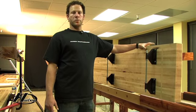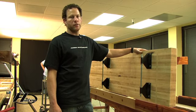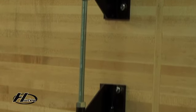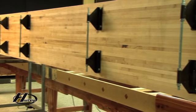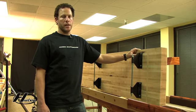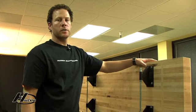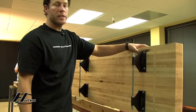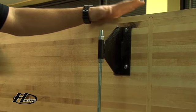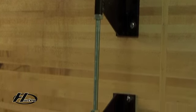The next step is to get your plank ready to be put in the cradle. Make sure you have plenty of help because these planks are very heavy. Your plank has climatic adjusters, and the amount varies depending on the length of your table — it could be anywhere from three to eight. If your table does not come with them already attached, this can be done easily by putting the lag bolts into the pre-drilled holes and tightening them down. Do not worry about adjusting them right now — this is done after the plank is inserted into the cradle.